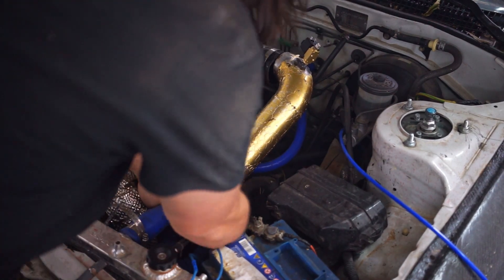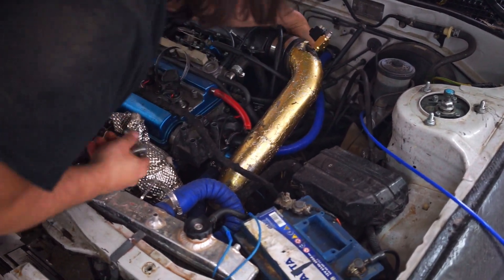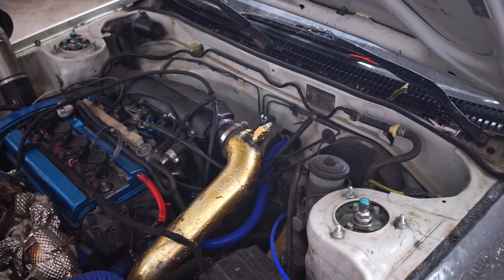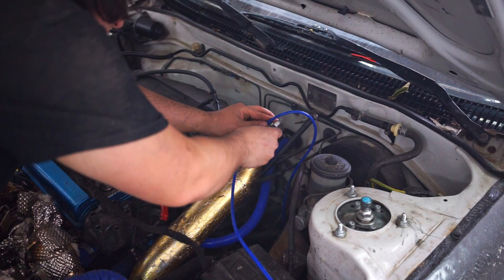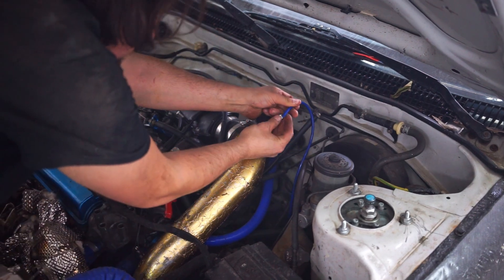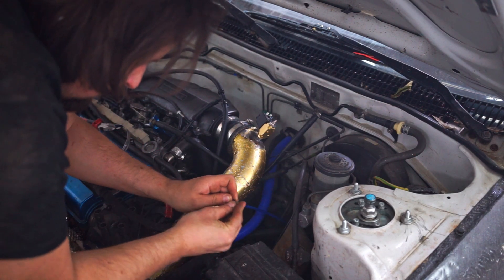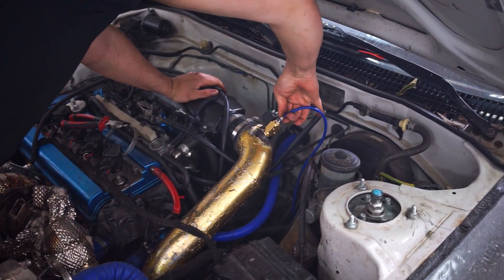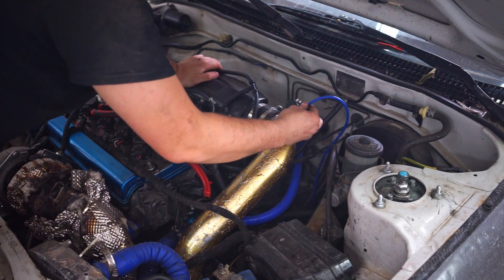When I'm done welding, I'm going to screw the nozzle in and then screw the solenoid on top, then pull back my intake piping. After that I just need to connect the nylon tubing to the solenoid so that everything is connected — it also needs to be connected from the tank to the pump, but that's pretty easy. Note that the solenoid uses a compression fitting instead of a push-on fitting, so you need to unthread the nut first, push on the hose, and thread the nut back on. Make sure everything is tight so the hose is not slipping out, and make sure all connections are good and nothing is going to leak.